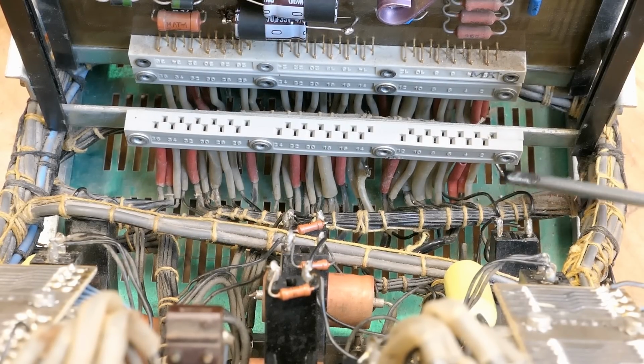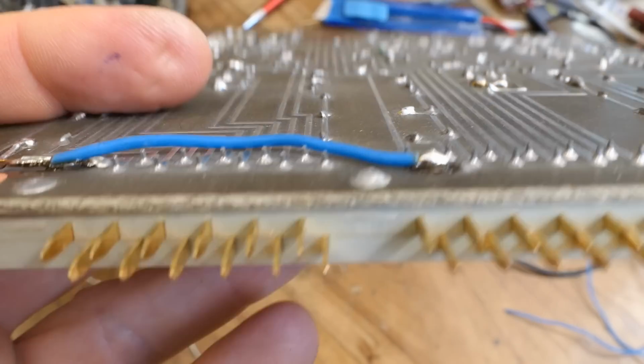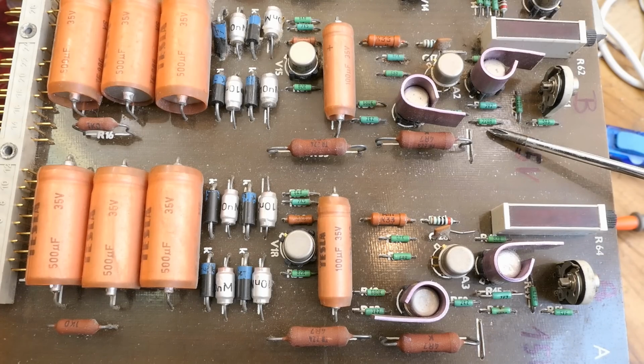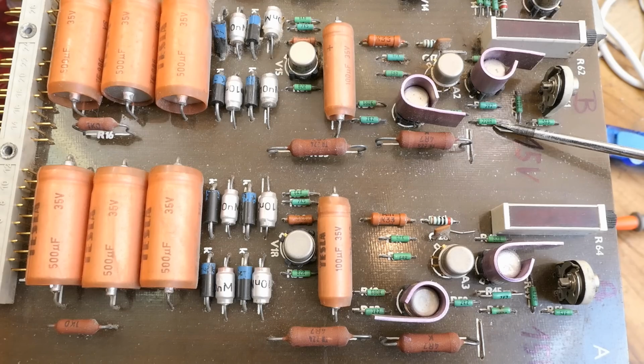Okay, the wire from the pin 1 is now rerouted to the pin 14 of the socket, which was unused, and it's also jumpered to this one on the board. And I also noticed that the burning resistor, 820 ohms, might have been actually replaced already with a bad value, because in the other identical section, in the same position, there is a 220 ohm resistor instead of 820 ohms. I guess somebody was already trying to solve this problem and already once replaced this resistor, accidentally putting 820 instead of 220 ohms in it. In the other identical 15 volt section, the same resistor is 220 ohms and has no signs of botch soldering.